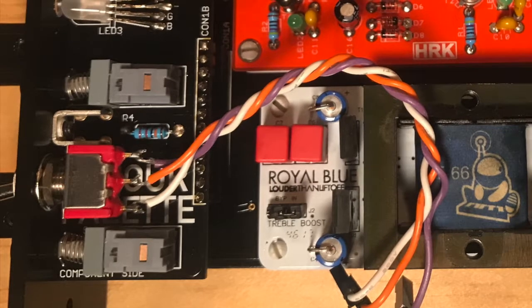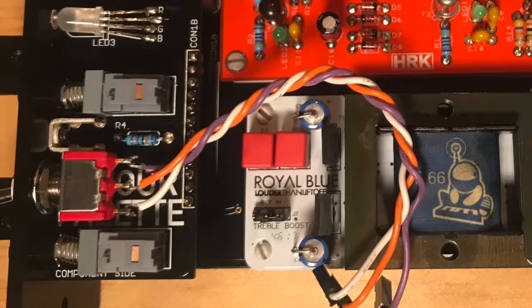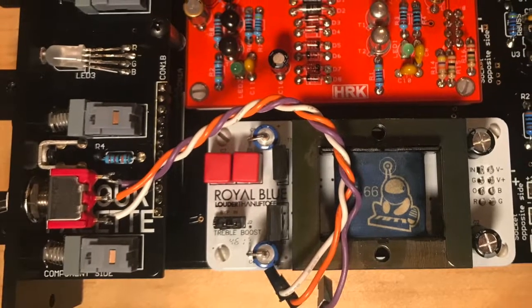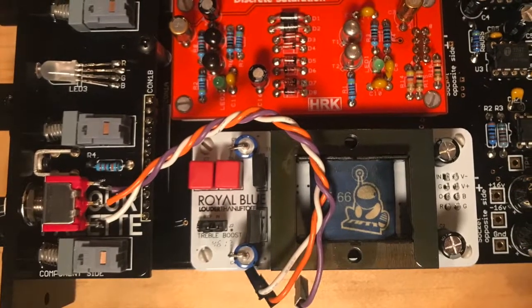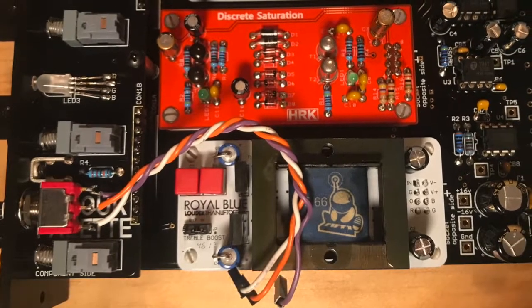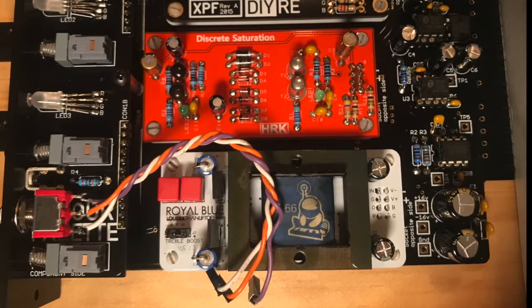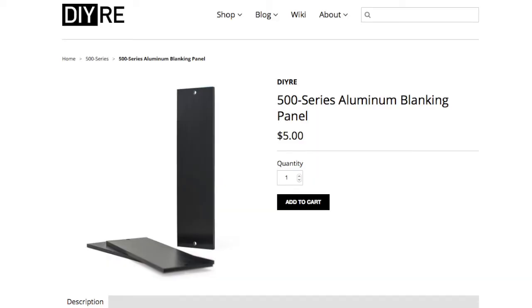It doesn't matter what order the wires go into, because the actual jumper part of the wire is what you'll pay attention to when you're connecting it to the color card. Here I have my switch all wired up and ready to go. As you can see, I've chosen to mount mine directly onto the faceplate of the color palette host. I don't recommend that you go this route unless you're very confident in being able to drill a nice, clean, and accurate hole. Otherwise, use a separate faceplate like this, and you can just mount your switches to the other faceplate.